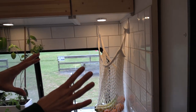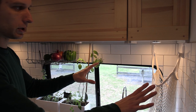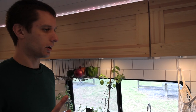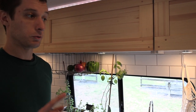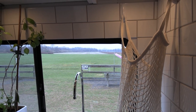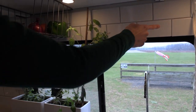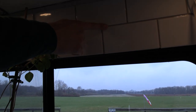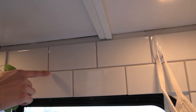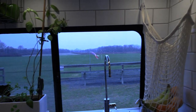We did a pretty typical looking counter backsplash, but there is one distinction — we didn't use standard tile grout. The reason is that tile grout is rigid, and when the van moves and flexes, regular grout would crack. So this is actually silicone caulk. It's a lot harder to do than standard grout, but the results are something that's going to be durable in this sort of application. We liked that the color kind of accents with everything else.